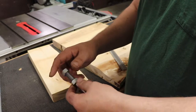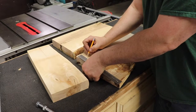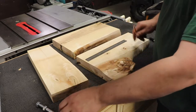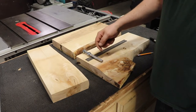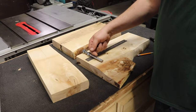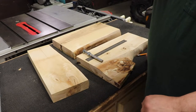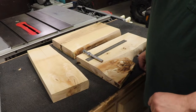and then threaded this end so that the plan here is to go cut about 1.5 to 2 inches off of this board here on one side of each of these boards. Cut a straight line there, and this bolt is going to set in between and drill another hole into this board so that this piece of the smooth rod will support the shelf. I'm gonna stop talking and show you how I'm gonna do this. It'll probably make a lot more sense that way, but that's just kind of a rundown of what's going on here.